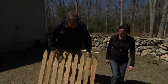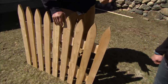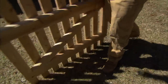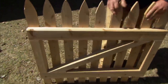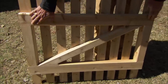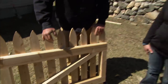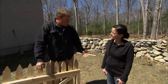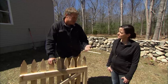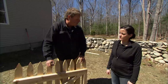Here's one part of your new gate. This is all cedar — you have a lot of options with cedar: you can paint it, you can stain it, or you can let it go natural and it'll go gray. But the most important part of a gate is in the back — look how beefy the back of this gate is. You've got 2x4 top and bottom rails, 2x3 side rails, and a 2x3 crossmember. This is going to keep that gate from racking. You had a special-sized opening, so I had my fence guy Mike McLaughlin make up this gate. But if it's a good tip, you can go to a fence company, give them your opening size, they'll make the gate, and you can install it yourself.